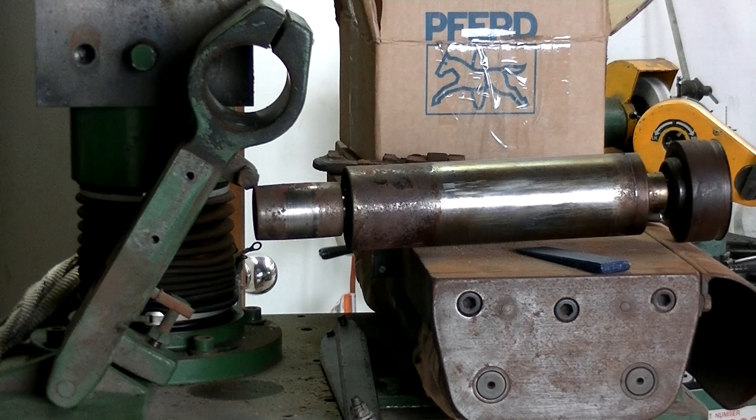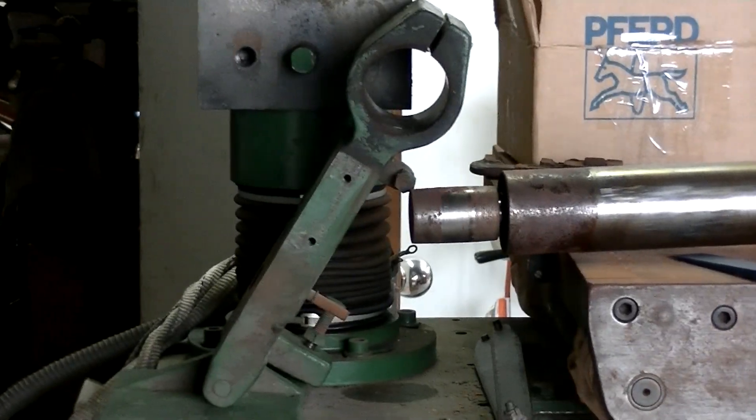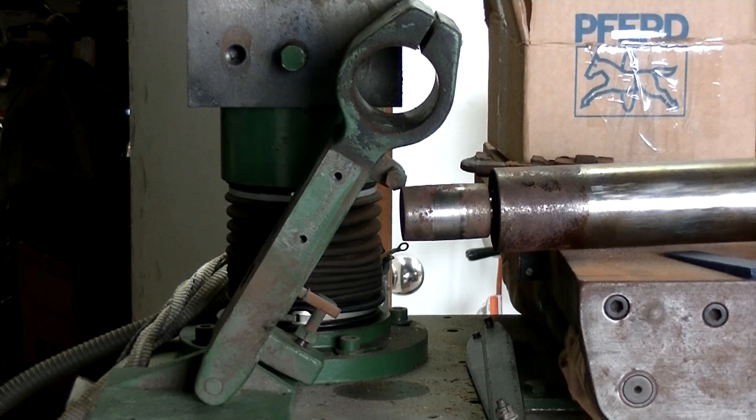Two bits of very, very good German engineering. The spindle will require new bearings — it does turn now but it's a little bit notchy and with something that spins fast I'm not prepared to take any sort of risk. The bracket is one great big lump of either SG iron or cast iron, very very heavy. I might actually machine it down — it's going to be a little bit thick sitting up on top of the old Cincinnati.